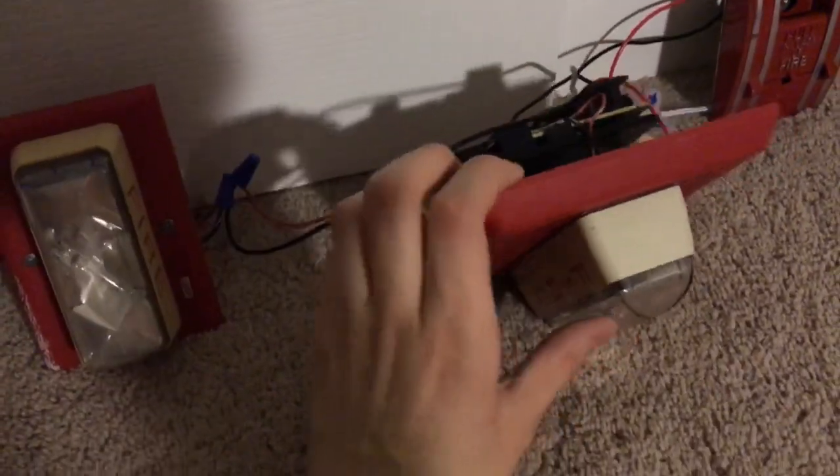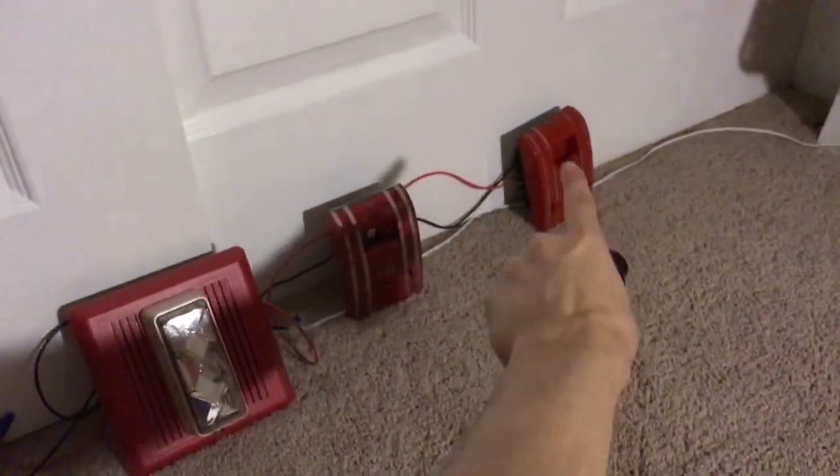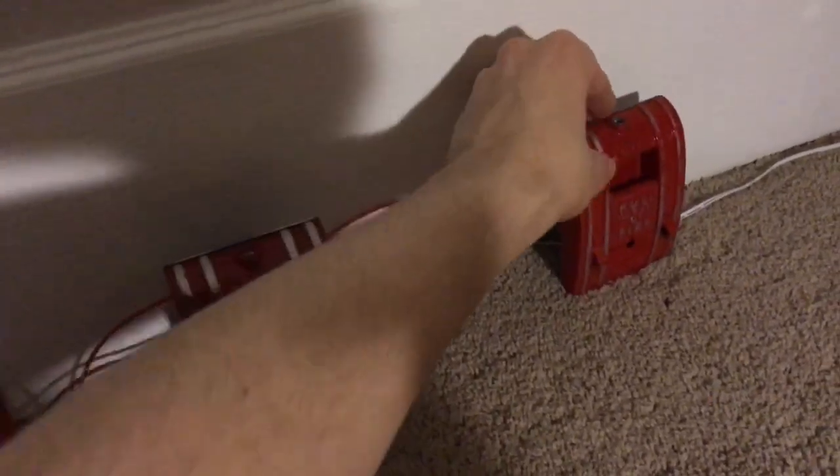Change it to continuous. There's a jumper right there. Now you can probably see it without me blocking the light — right there. We are going to remove it. Jumper's out — put it over here. And now the Integrity is on continuous. The security screw on that 270-SPO is broken, which is why I'm not a huge fan of the security screw model 270s.